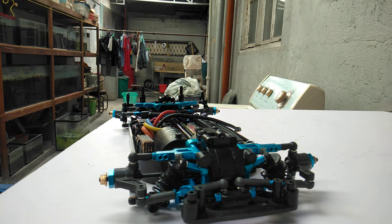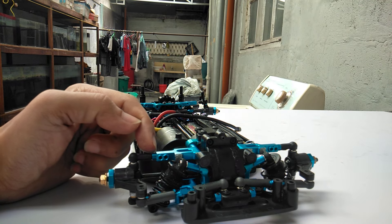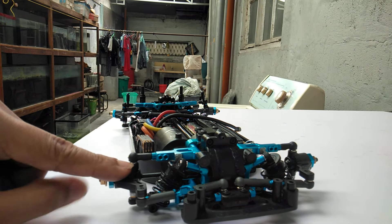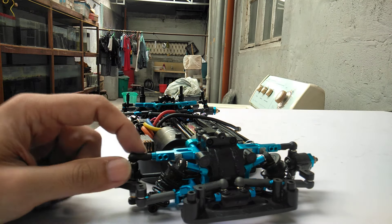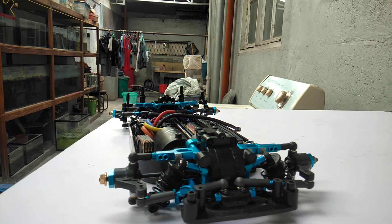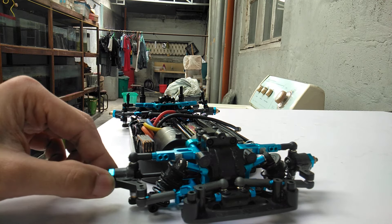Or if there's a slight tap, it will move. This design has no free space — there's a 3 mm spacer here, and on my design a 3 mm spacer gives me 2 degrees. If I want to change it, I can just unscrew the top, put a 2.5 mm spacer and get more camber, or add a 0.5 mm spacer for less camber. I don't need a camber gauge anymore — I just go by shims. And it doesn't move; there are two set screws to lock it in place.